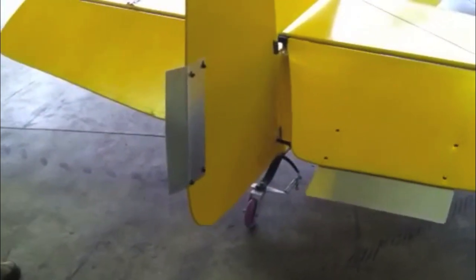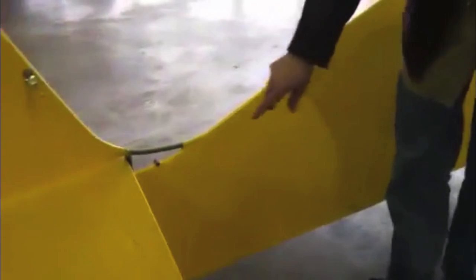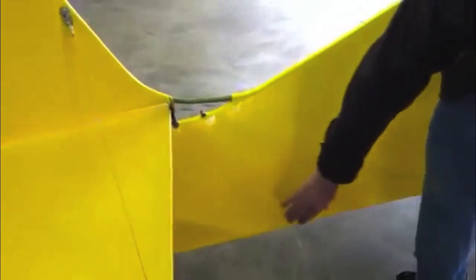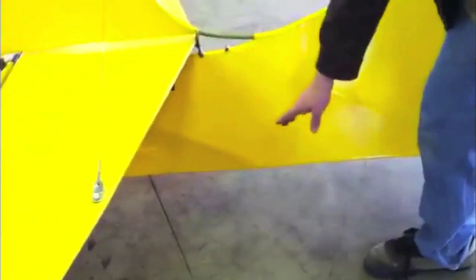This looks gnarly but I bent it by hand and it's just right. The control surfaces are very, very well balanced. Check along here as well — this structure was all redone. That was part of what I learned: we had too weak a structure. This piece right there is a standard piece, and there's actually a piece of sheet aluminum plating it. It's a triangular structure that goes from bottom to top, much like the skin on the side of the fuselage. If you're going to lift, lift from there — that's the only place you have permission to lift the plane on the back. Do not lift it from the bottom; you'll bend that.